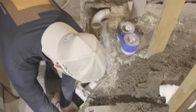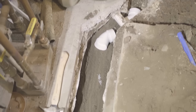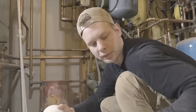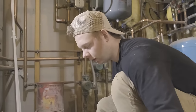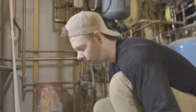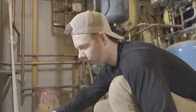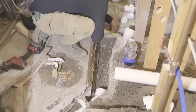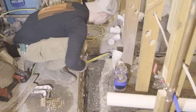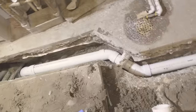If you have a toilet going into a PVC line, you have to have at least a three-inch PVC pipe. According to UPC in Minnesota, we can do up to three toilets on a horizontal branch on a three-inch pipe before you have to go up to the next size, which is four-inch PVC. The next thing is getting the section into this 90 — let's keep getting this main piped in towards the bathroom group.